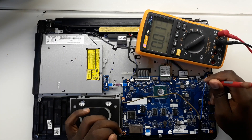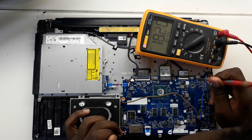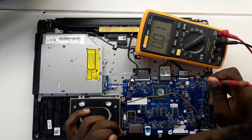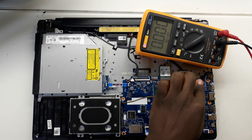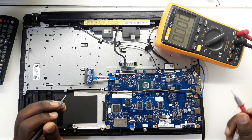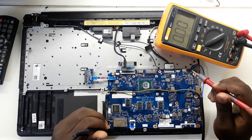On the second MOSFET, power does not go through, and that's why you don't have volts on the motherboard. Now there is a problem here because this MOSFET should not be opened by 19V — it should be opened by a voltage that is a bit lower than this. So I'm going to try to cross-check and see why the second MOSFET is not opening up. I'm going to check for the signal that turns on these two MOSFETs and see if the voltage is there.